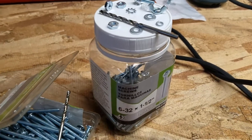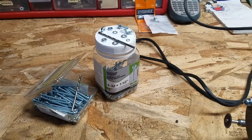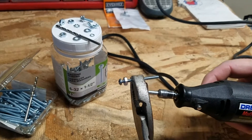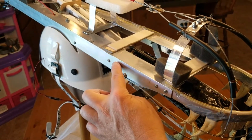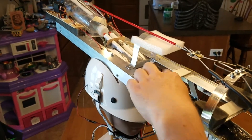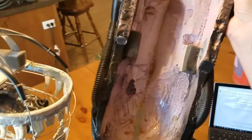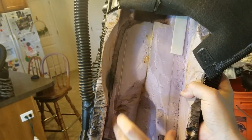I bought long number 6-32 screws with a 5/16th nut so all the hardware is one uniform size on this alien head. Simply cut the bolts down to the length desired, making sure to put a nut on before you cut so that removing the nut will make sure the threads are good. I used one 48-inch aluminum L-bracket, cut it into two pieces, and the spacing in between is based on the water bottle fitting in between there, and then the foam insulation that I use, which is 2 inches, and the L-bracket will sit right in here.